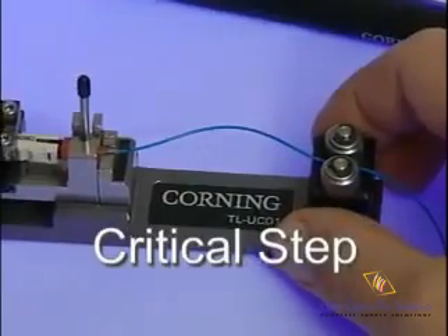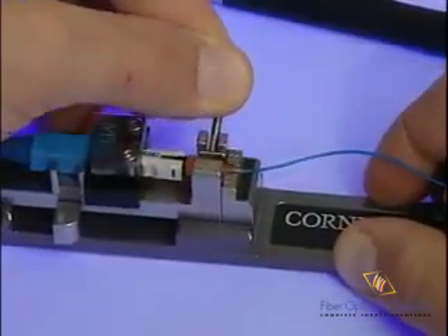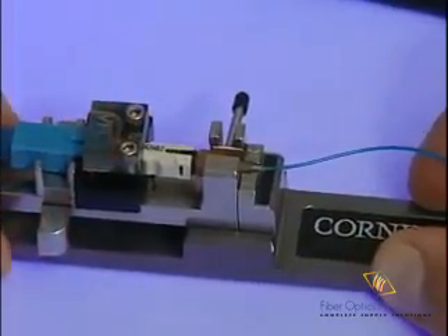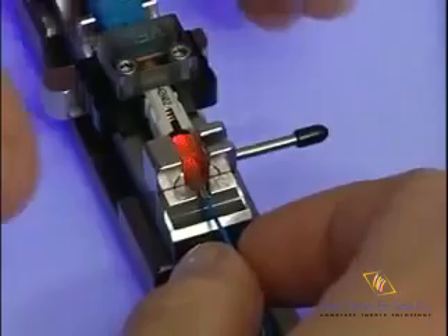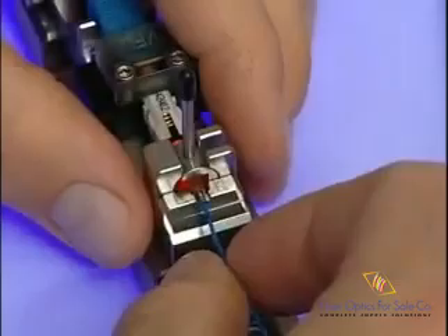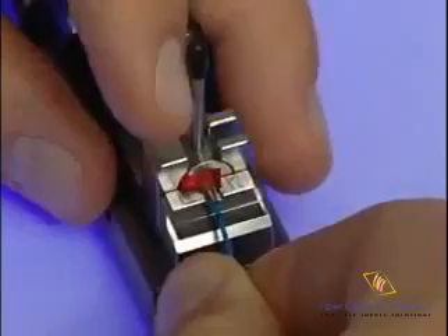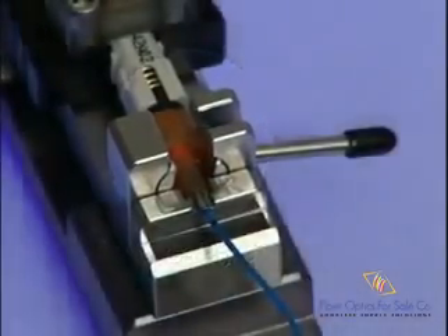This bow is important in helping to keep the field fiber and the fiber stub touching. Rotate the wrench past 90 degrees to cam the connector. Inspect the area where the red light near the cam was observed earlier — the light should noticeably dim, but may not go out completely. If the light does not noticeably dim, un-cam the connector and pull the fiber back a couple of millimeters, roll it in your fingers, then reseat and re-cam. If the red light still does not noticeably dim, un-cam the connector, pull the field fiber out, re-cleave it, and try again.